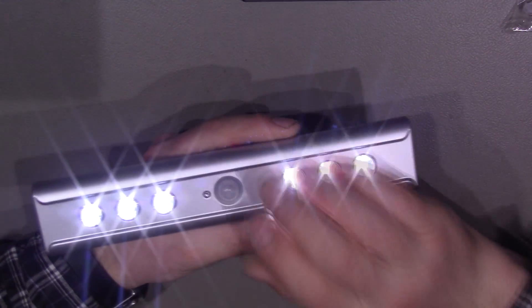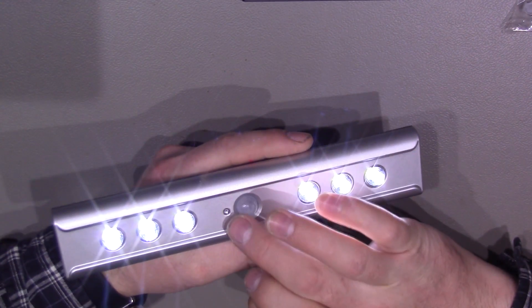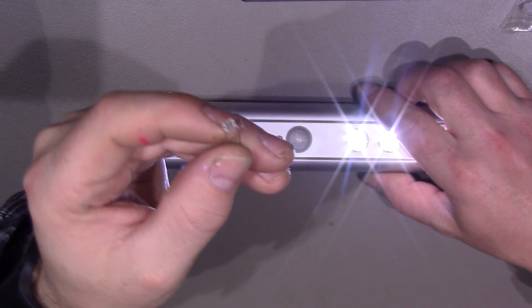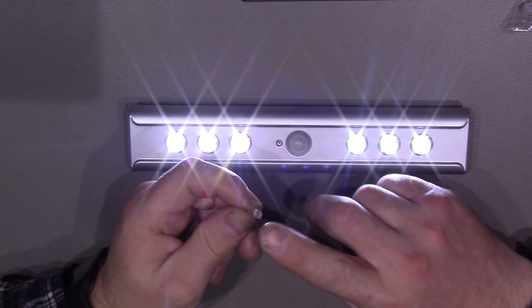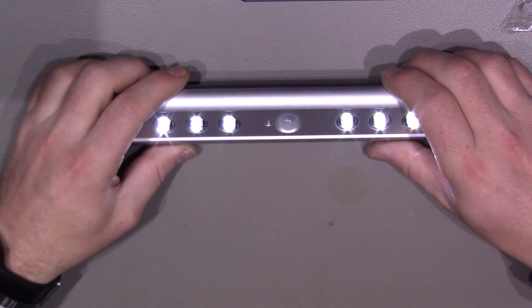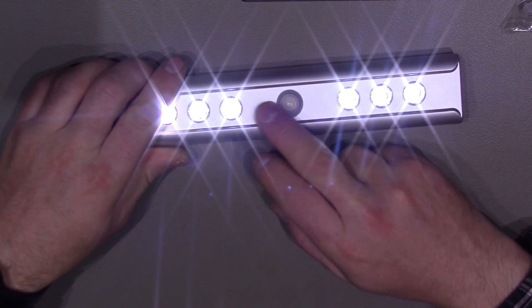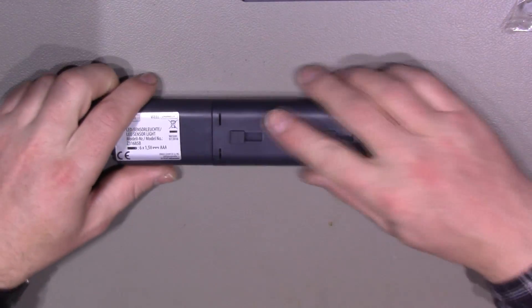What I thought was interesting about this one is the nice small PIR - it looks neat. And this must be the light sensor, but it's not what I was expecting. Normally you would get something like a standard LDR - light dependent resistor - which is what you'd typically see in one of these type of lights to detect when it's dark. This one is certainly different; it looks to me just like a standard LED but it has a sort of black square in the middle - some sort of die underneath the LED encapsulation. So I thought we'd pop it open and have a look inside.